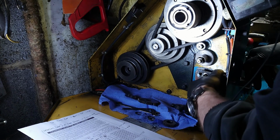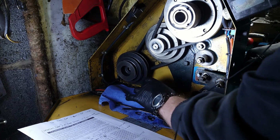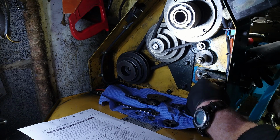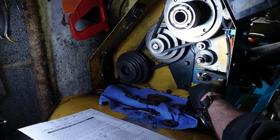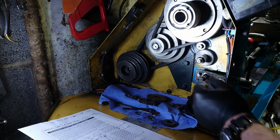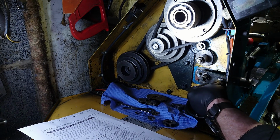Right, take the clutch off. Now what you've got in here is we take this one off, and that is 63. What you've got in here, you possibly can't see, there's a pin holds this block to the shaft. It has a tendency to fall out on new lathes. This one has been apart a few times, and I've enlarged it, shall we say, so it's a bit of a snugger fit. So we'll go from this backwards now. So the first one we want is the 27, which is this teeny one here. So that can go on first.